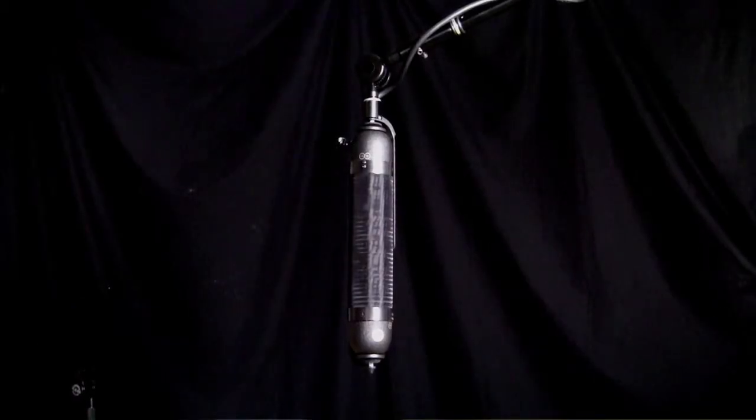And of course, there's the sound of ribbon microphones. They just sound terrific. They have a transparency. They transport you much closer to the source of the sound, I think, than any other microphone. You hear through the microphone right to the source much better than you do with dynamic microphones, for sure, and oftentimes better than condenser microphones. But you have to realize they have limitations. Low output, very fragile, cannot be used outside at any time. They can't even be used if they're close to an air outlet of your HVAC system. But you can use ribbon mics to get an excellent sound. And the VT-12 is the perfect microphone preamplifier for providing that sound.